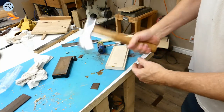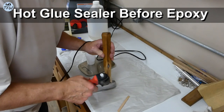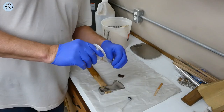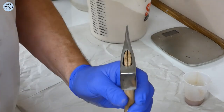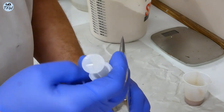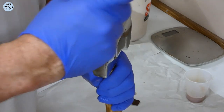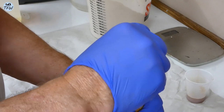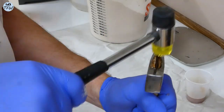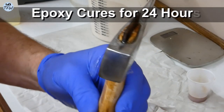The weight and balance actually feels pretty good. There are a couple of thin gaps between the handle and the axe head, so I'll seal up the underside with some hot glue. From there, I'll fill up the gaps with epoxy before hammering in the wedge. This little boat-building epoxy syringe helps fill these tight spaces. With the wedge hammered in place, I'll put the handle standing upright in my bench vise for 24 hours.